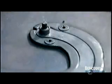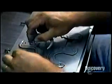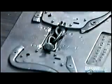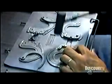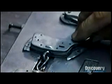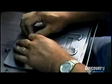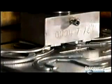They install studs in the outer framework and attach the ratchets to them. The swivel link fits into the little grooves in the framework. They hammer the inner frame on, and then lift the top and bottom assemblies together. A tap with the hammer holds them loosely together. Then a press bears down to make a tight seal.